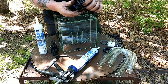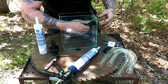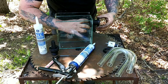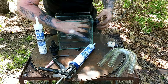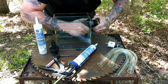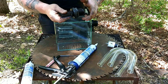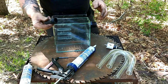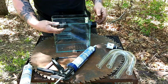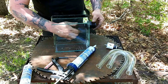If you trust the rubber, go right ahead — I'm not a very trusting person. Take your seal, run it onto your bulkhead, run it through the hole, and press it against the bottom. Then slide your next ring on and screw the nut up on there. Tighten it down — you don't want that gasket to bow out, so just snug it a little bit. That's pretty much all there is to plumbing these things.